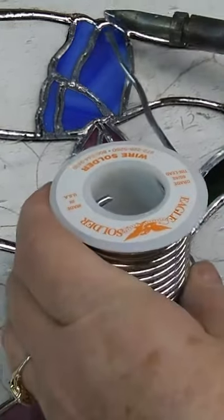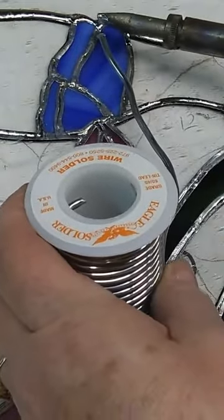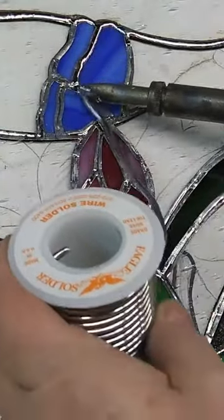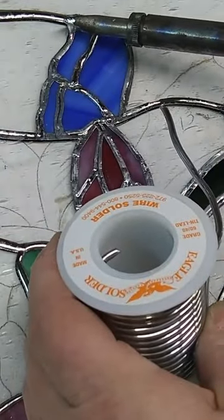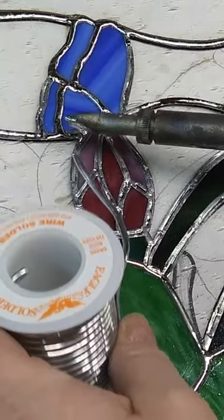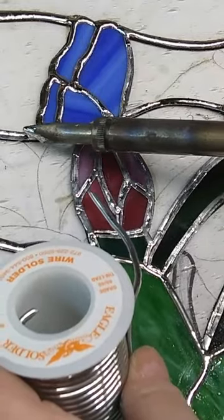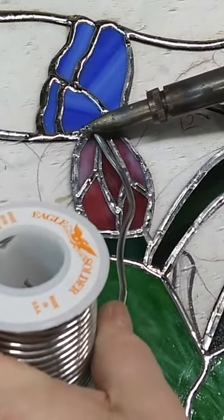This part real quick. Notice when I did this line here, I kind of dipped down into the seams a little bit, because I found that when I do that, it's easier for me to melt back and then go forward. And that gives me a nice point right there. See that? Go backwards a little bit and then come back and finish your lines. Okay, the same with this. So I'm almost making myself a T when I'm finishing it there. Does that make sense? I don't know.